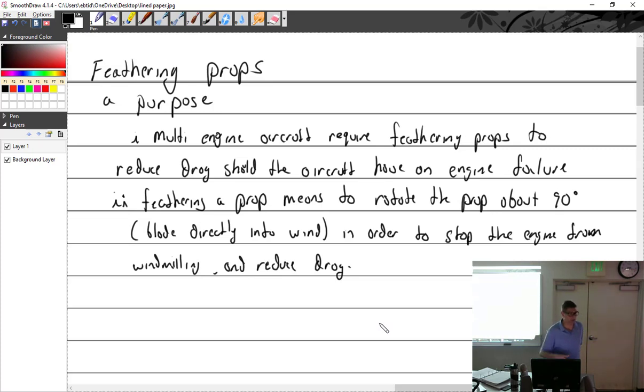You lost part of a propeller tip, and that going around is shaking the hell out of it. So you shut off your engine, pull back on the yoke, go into a stall. There's no wind basically at all, so that stops the propeller from moving. Recover from the stall, and I guess if you keep it at a low speed, it won't start the prop windmilling. God, that would be scary. I can't imagine.